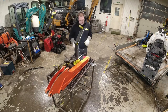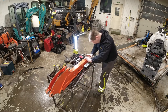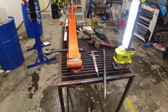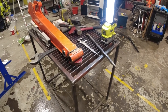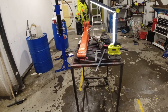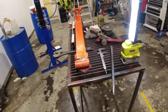I think we have it pretty much aligned now, so I'll start tacking all the corners together so we can move it around, tack the plate inside, and make sure everything is as level as I can get it - it's mostly eyeballing. When I was grinding I could see rust all the way around the cracks, so this has been going on for quite some time. We didn't catch it before it was almost too late, but we managed to finish the job before we saw it.